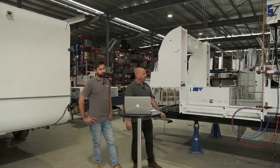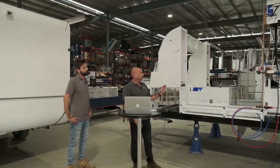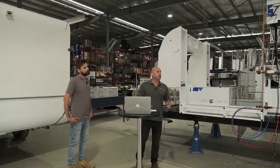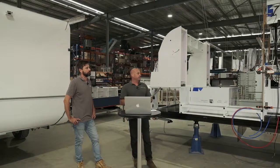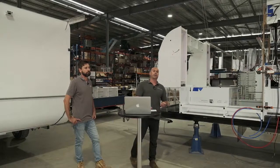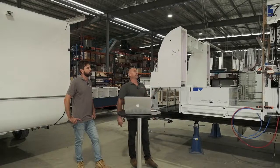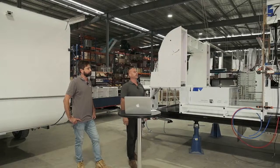So the fiberglass floor that we have, composite floor, it's also insulation, but the cabinetry itself, the way we build that becomes a framework. So the sandwich panel walls are very lightweight, and we don't have any material changes in temperature which can cause condensation and things like that by using the composite laminates. By gluing our floor cabinetry to the floor and bonding the walls to the cabinetry, that becomes our structure, and we really rely on that, and that gives us that rigidity in our whole frame.